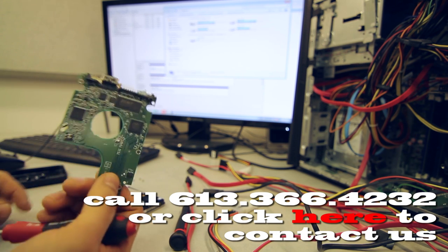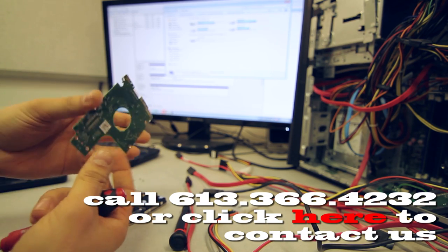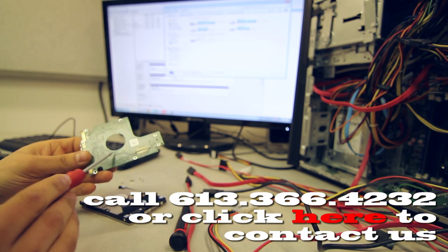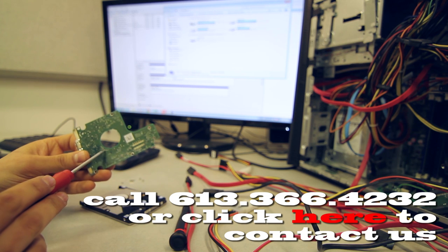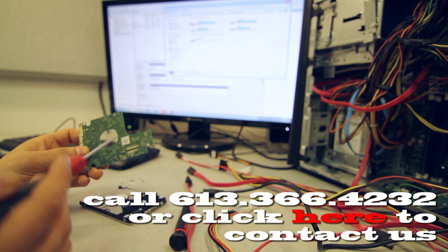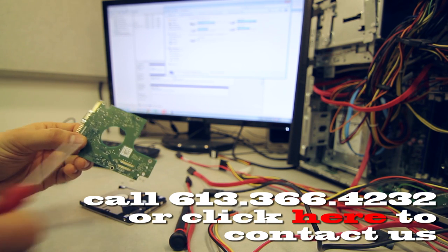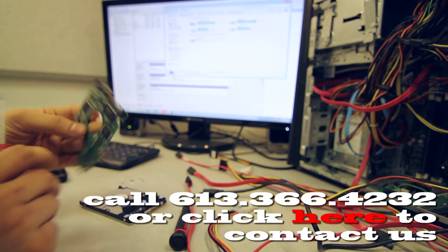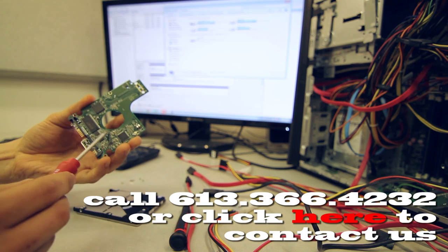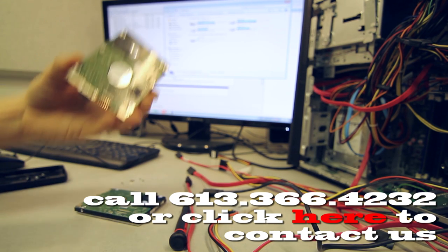If they match, chances are this is a compatible board and you can just swap a SATA board right on it. An alternative would be to solder a hardwire SATA connector, and that's done through these four points here, E71, E72, E75, and E73. I'm also gonna post the pinout for you guys, if you're interested and have soldering skills, for how you can convert this USB board into a SATA board. You would also have to remove some capacitors to disable the USB bridge, but this is what the final product would end up looking like.